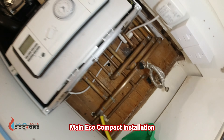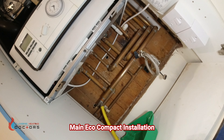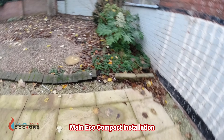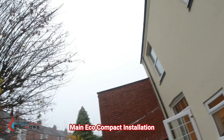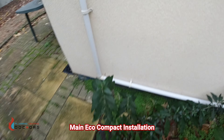We've protected all the surfaces as you can see. This is the old boiler which is coming out. It's already a condensing boiler so we should be able to connect back into that condensate pipe. We'll get rid of the filling loop because the new one has an internal filling loop. Outside it's quite cold and foggy - it's December. The condensate is 32mm which is fine, running straight into a stack, which is good. The flue is all good too.